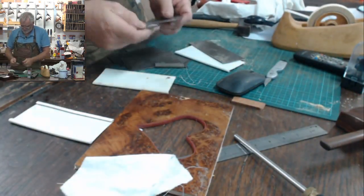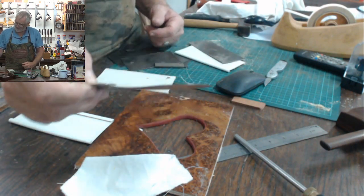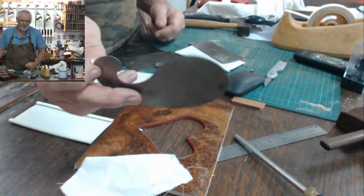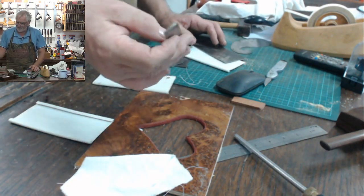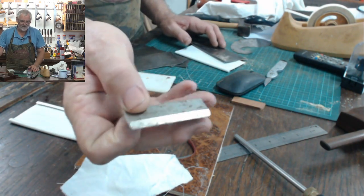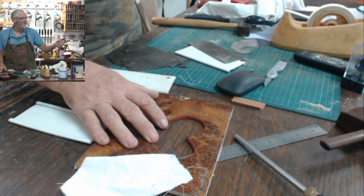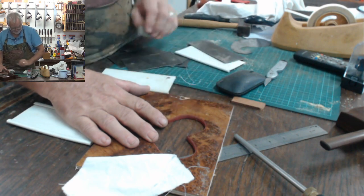There are various types of scrapers. It's a gooseneck scraper. Hence, funny shape for doing concaves and a bit of convex here on the inside. They're an absolute shocker to sharpen, but basically you sharpen it the same way as I'll show you on a flat one. That's one I use for box making. It's just a little piece of blade off my thicknesser, and I use that very effectively. I just cut a bit of blade out. That's all. And that's good for just getting glue spots off.